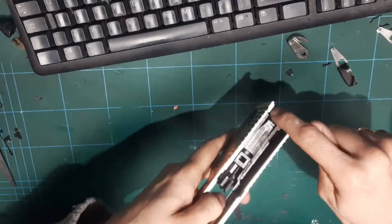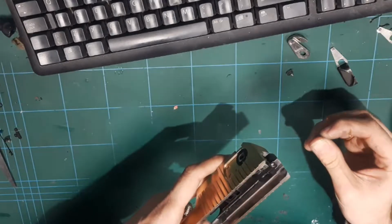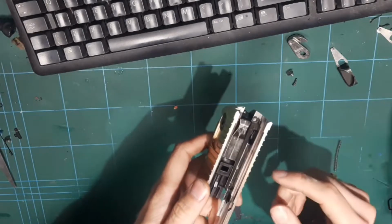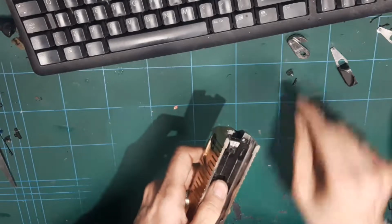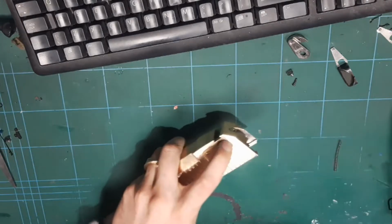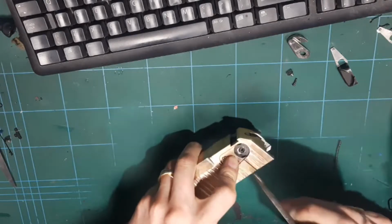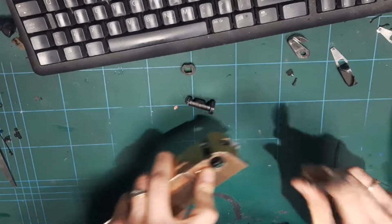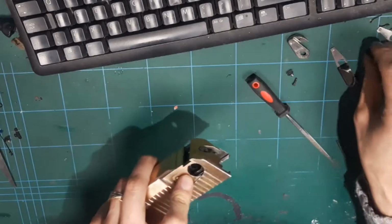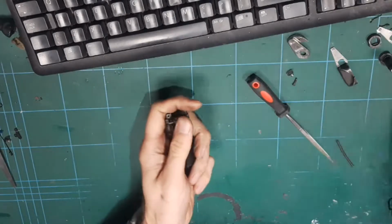Then there's four screws there, 1, 2, 3, 4. They're usually really tight. From the factory, they have a lot of thread lock on, very difficult to get out, so take your time. I rounded one of them and then had to drill it out, which is a pain. Anyway, just pop the piston slightly forwards. Just lever these bits off, or push that bit through like that. That's another way of doing it. And then the whole piston assembly will come out.